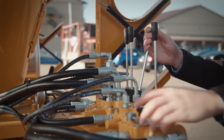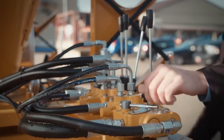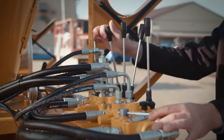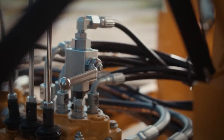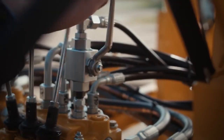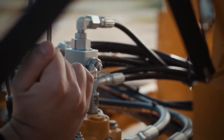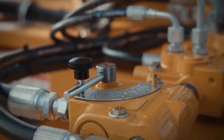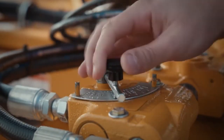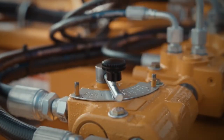The hydraulics are self-contained with a heavy-duty gear type pump. The operating controls are conveniently mounted together for easy operation. Operating and safety decals are prominently located by the controls for the operator. The airlock control lever has a reverse, neutral, and start position. On the left side of the cluster is the airlock RPM control, a 90 degree rotating switch, while a knurled set knob holds the airlock RPMs.